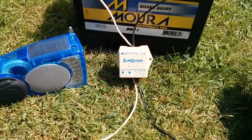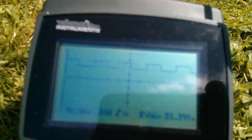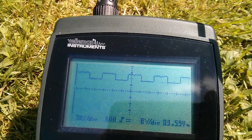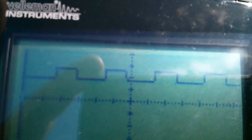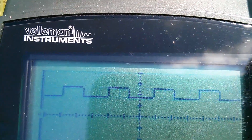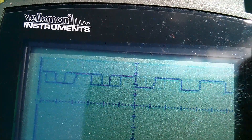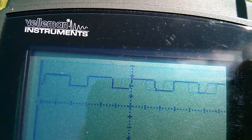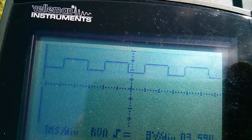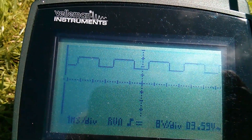I've turned the radio on so we can hear the pulse, and there's the trace on the scope. It's currently set to 8 volts per division. I can't sync it at the moment because it's not transiting through the zero point. The lower part is nearly two divisions — that's nearly 16 volts, so that's the battery voltage, about 13 to 14 volts. The upper voltage is almost three divisions, so almost 24 — about 22 volts. So it's transiting between about 14 and about 20 volts, which is what we were expecting.